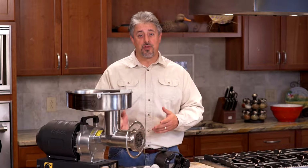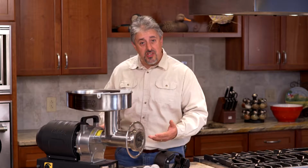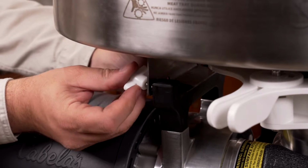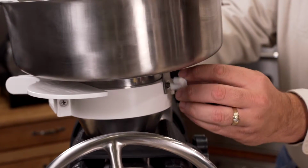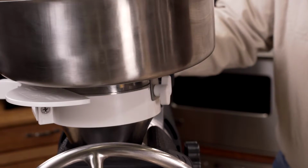Next, align the holes in the tray support bracket under the tray with the holes in the tray standoff handle. Then adjust the tray standoff to achieve proper alignment of the tray with the standoff. Insert the included thumb screws through each of the tray bracket support holes into the tray standoff. Insert the remaining thumb screw through the front tray tab and into the threaded hole of the safety flap.